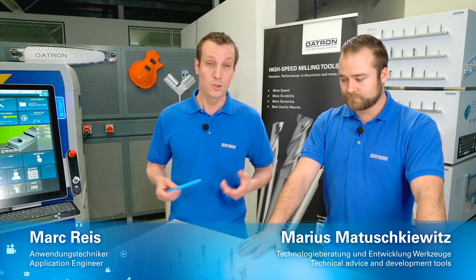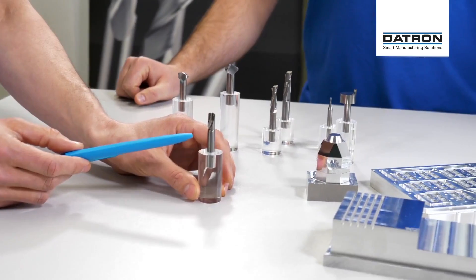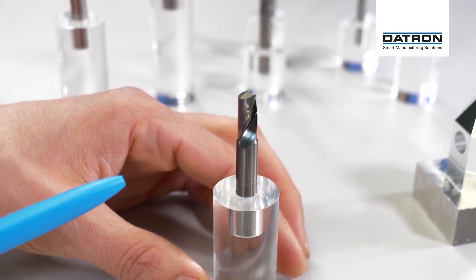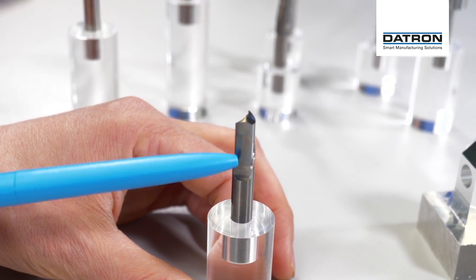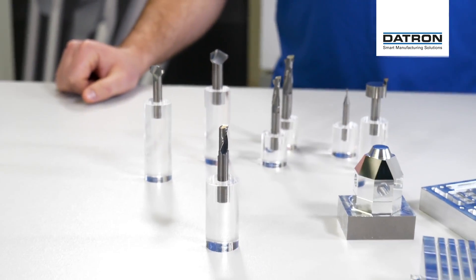Marius has a very high level of competence in tool technology. He works at our tool grinding shop in the development of tools. Most of the tools that we use are single flute end mills — not the most common tool in the machining market. The special thing about a Datron single flute cutter is that it's balanced. It has a balanced cut because single flute cutters by nature do not have the center of weight in the center of rotation, causing unbalance problems in the milling process. That's why we have the balance cut — this is a USP from our side.